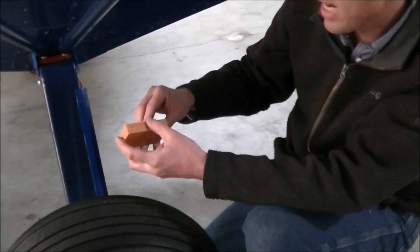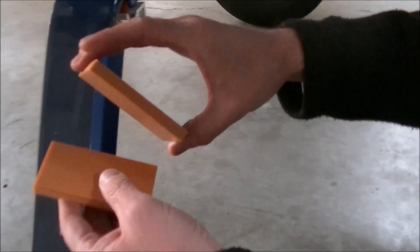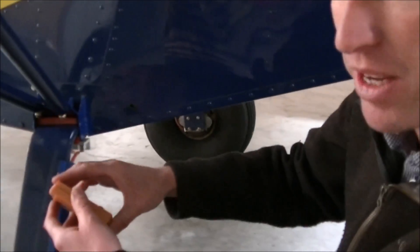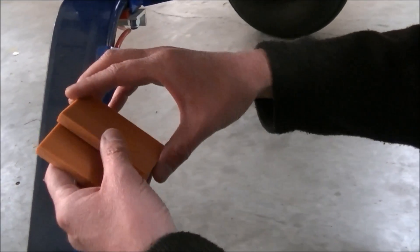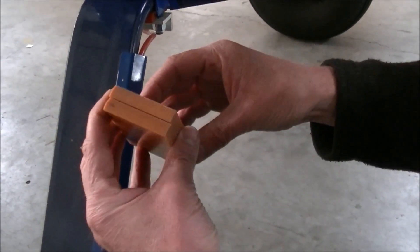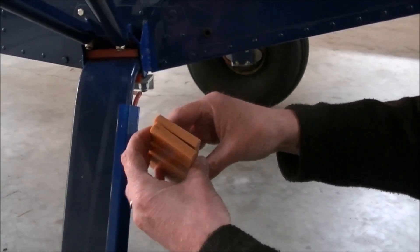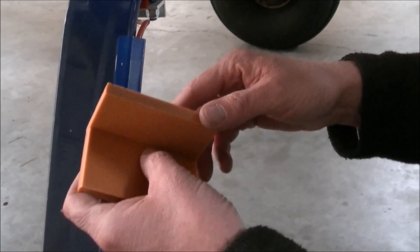The 701 either has rubber spacers or the newer polyurethane rubber pads — we've been supplying these for about ten years. A lot of 701 builders use rubber tire sidewalls as their spacers; they're fine except they do slide out and wear quite quickly. I would recommend changing to the new polyurethane spacers. When you receive your spacers, you will have to notch them out for the gear strut bolts so the spacers will not slip out when the gear is flexing on landing. Those are available from Zenith Aircraft Company, and there is a drawing that shows the installation as well.